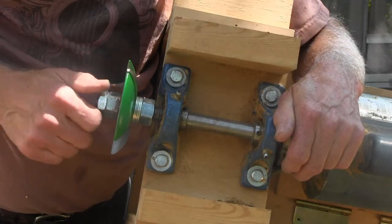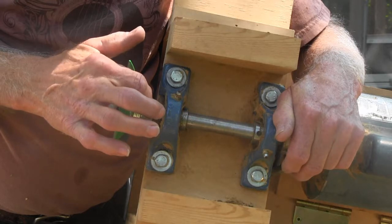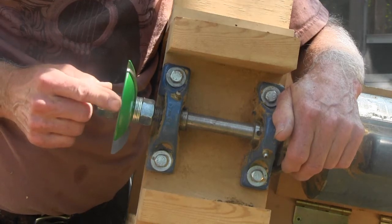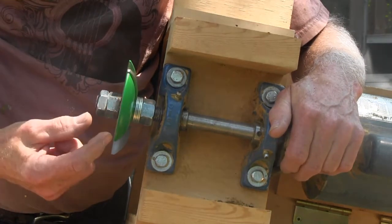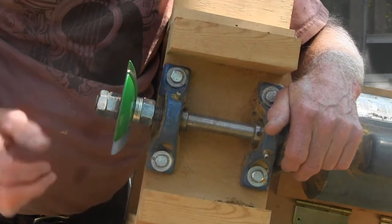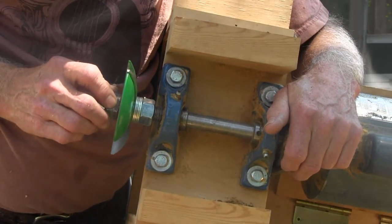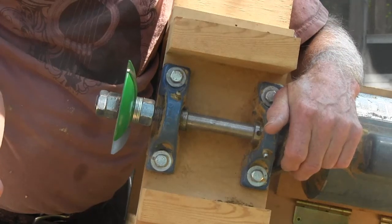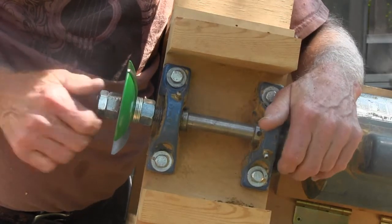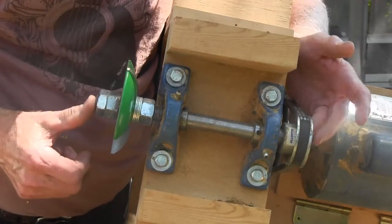The reason I have a nut on the bottom is because there are probably 50 different kinds of bits — some are thin and some are really thick — so you need that extra movement up and down for adjustment. You don't want any more of the shaft sticking above your cutter than necessary. Keep the shaft as short as possible above the cutter, and it all boils down to: the shorter the shaft, the better your cuts are going to be.